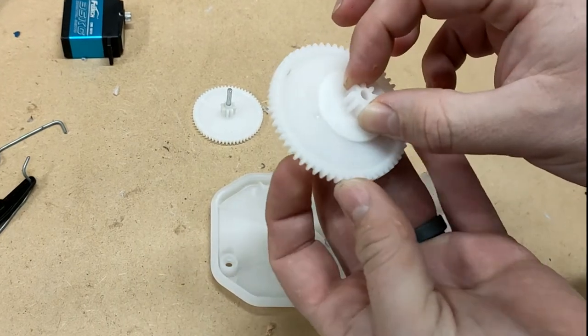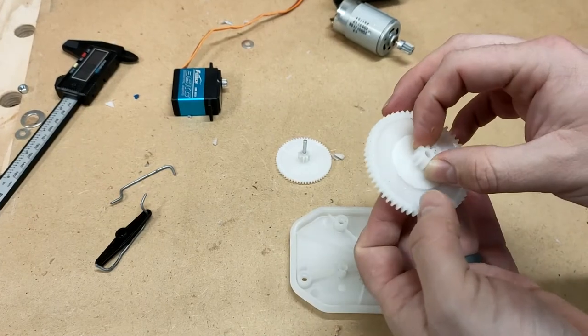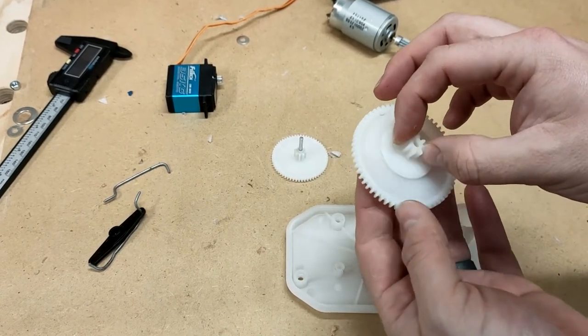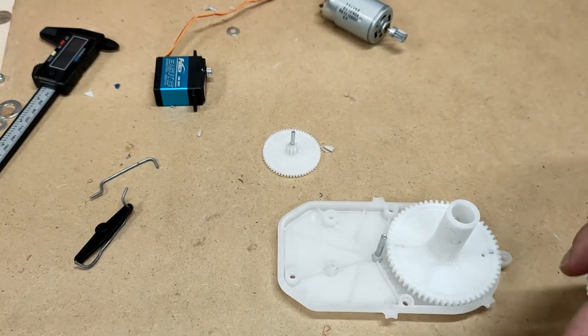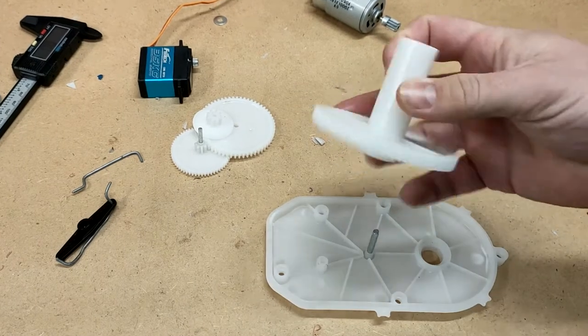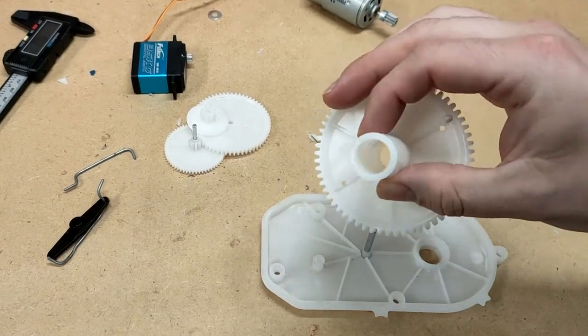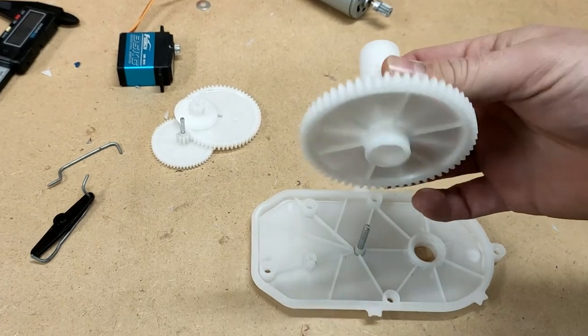When there's enough force that will slip. So when the child's trying to steer, that basically slips and that's what allows the kid to actually steer — makes a hell of a noise. And then we have the primary gear itself, which has a big hole through the middle, which is actually what the steering column goes through, and a simple bolt that goes through and locks it.